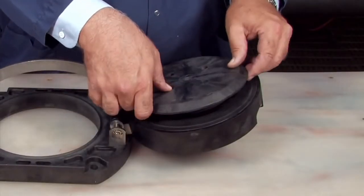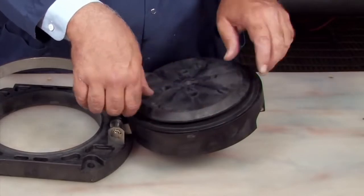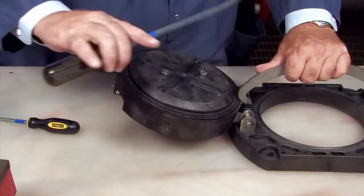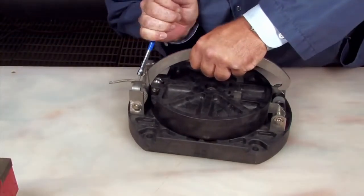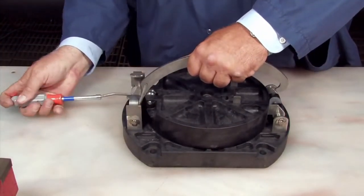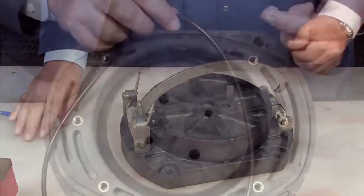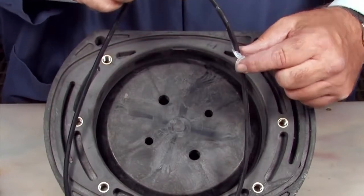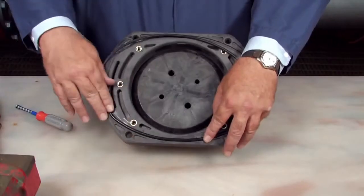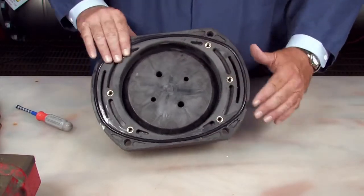Re-thread the retainer plate and tighten. With the check cleaned and repaired, replace the torsion springs. Prepare the checks for reinstallation by cleaning the O-ring groove and thoroughly lubricating the O-ring with an FDA approved lubricant. Lubricants should help to keep the O-ring in place during reinstallation.